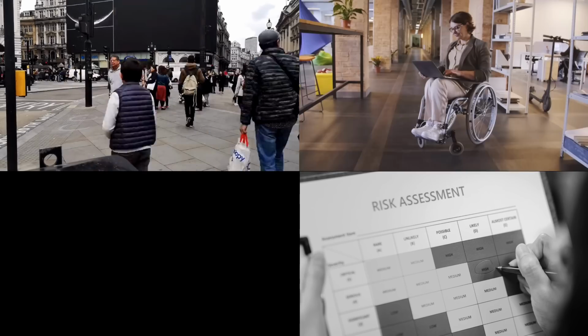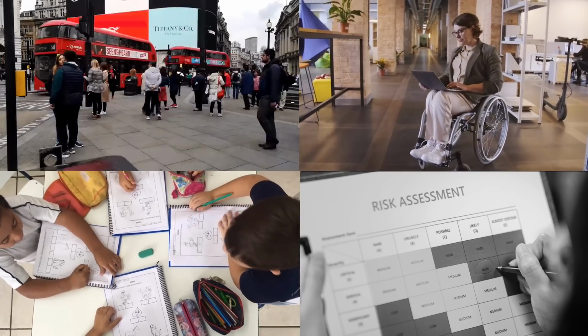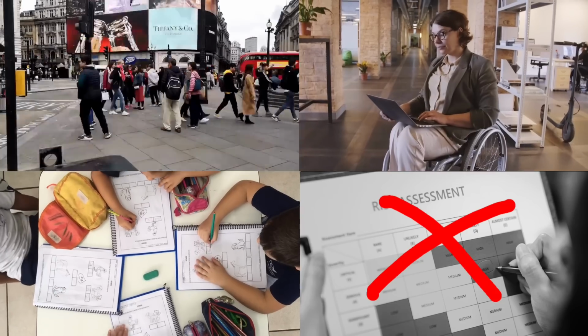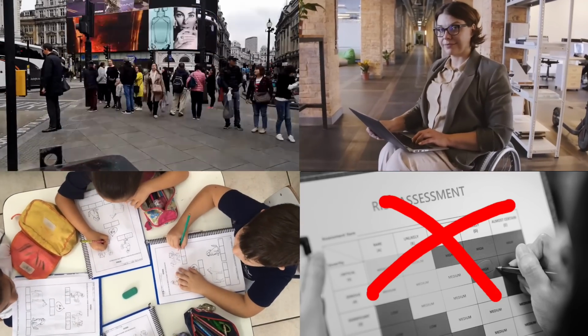However, this doesn't apply to places used by ordinary people, the disabled, or children. These still require the RCD and the risk assessment option doesn't apply. So that pretty much rules out vast swathes of electrical installations.